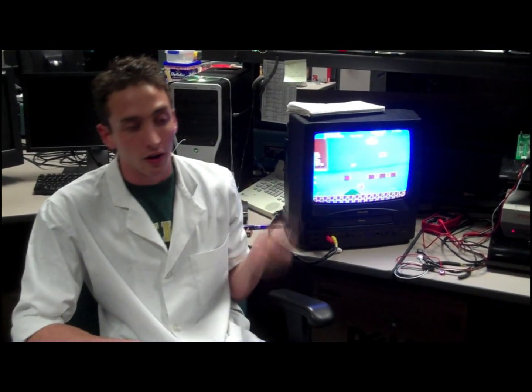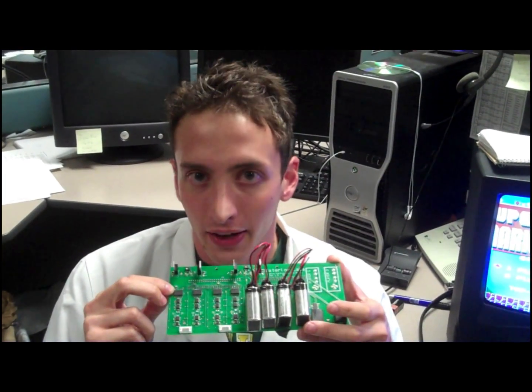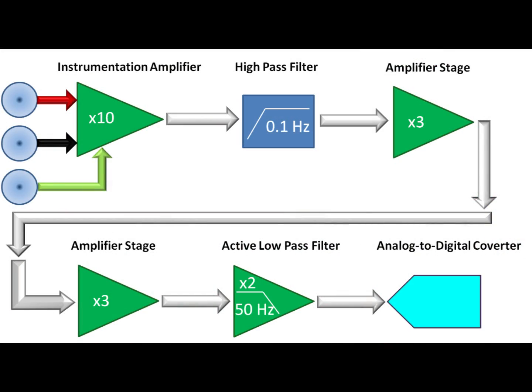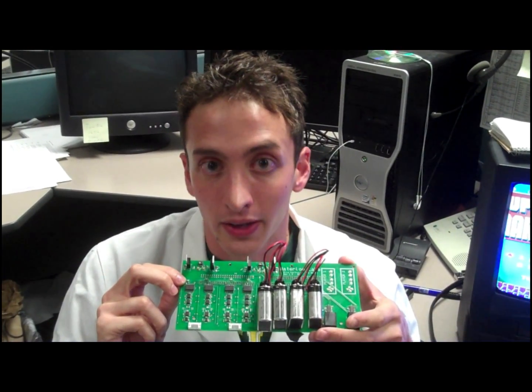And now we come to our final issue: electrical isolation. With any medical device, there's always some risk of shock. Our oculograph is just powered by 9-volt batteries, so even if there's a short, this is pretty harmless. However, our Nintendo, the TV, and the SBRIO all come from 120-volt wall power, so if there's a short in the transformer, you'll end up with 120 volts across the electrodes on your face — nobody wants that. That's where Analog Devices' AD7401 isolated analog-to-digital converter comes in. After digitizing the signal, it magnetically couples it across a dielectric gap, so there's no electrical connection between the oculograph and the SBRIO. The AD7401 can withstand 120-volt wall power indefinitely and over 3,000 volts for up to one minute, keeping us safe from shock. For more details, circuit diagrams, and layout, click the link in the description below.